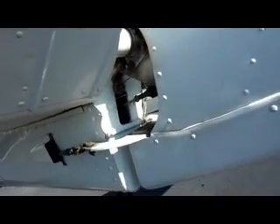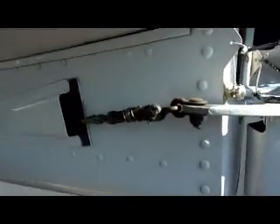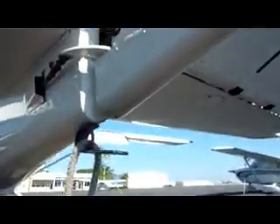Make sure this connection is fine here. Go under and check the elevator cable — make sure it's properly tightened. This is the cable that connects the rudder; make sure all the screws are intact. Make sure the under surface is fine, and remove the tail rope.